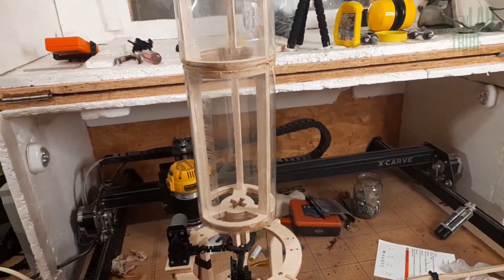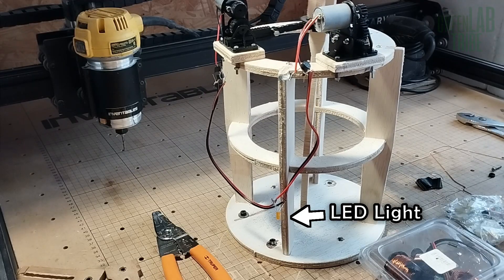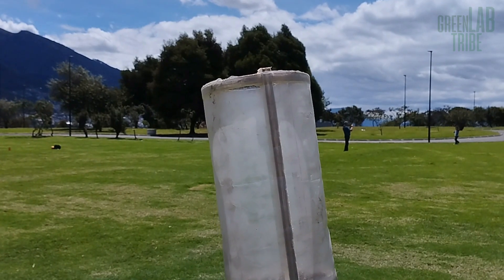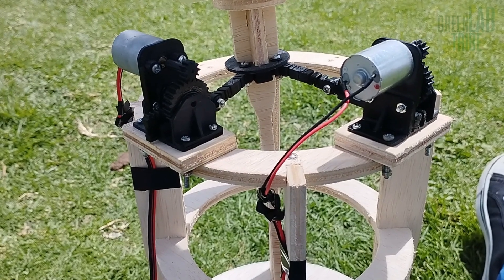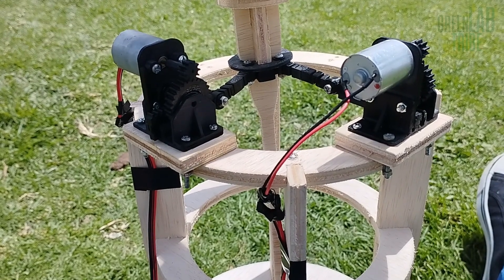I connected an LED light to see if the system works and at first glance it does — it works! Next step: test the device. I found a windy place, put the turbine there and let the wind do the rest. Did it work? No. I think I just oversimplified the thing. The blade vibrates but it's really subtle and the generators don't even get to move. I think the two problems are the pole rigidity and the vibration induction system. The pole is too rigid to move, and I clearly need to design a vibration induction system instead of just using these component generators.